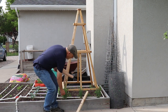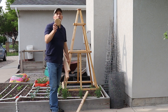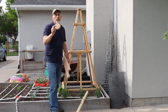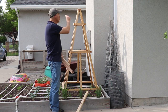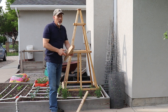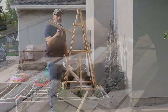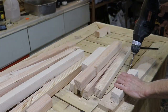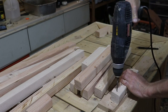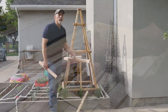On top of that, I chose a nice little round cap to put on the top — you can pick one of these up at your local hardware store, or just choose something to make it look nice on top. The one thing you do want to do is pre-drill your holes in all of these horizontal boards so that they don't split. Then we are just going to use screws to assemble these. Let's slide over to the patio and put this together.